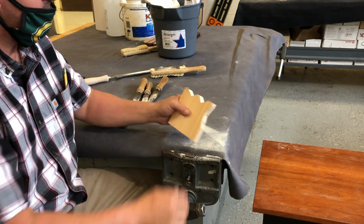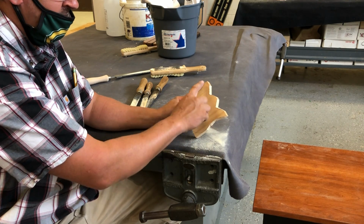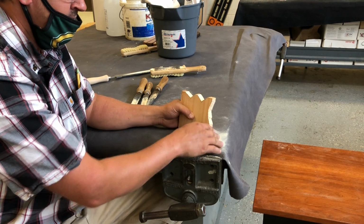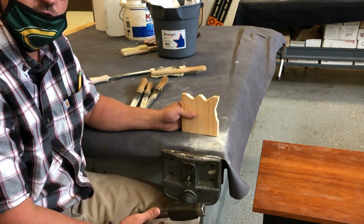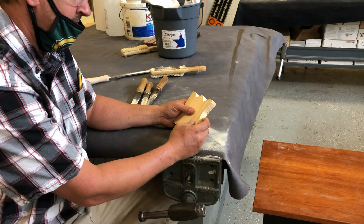All right, so now that we have gotten our tulip cut out to a rough shape here and here and here, maybe some of you have gotten this, we're going to go over the next step, and that's going to be on filing this down to a nice smooth shape and a couple of filing techniques. Filing is easy once you learn the technique behind it, but it's going to be a little bit challenging here in the beginning until we get to learn how to do it.